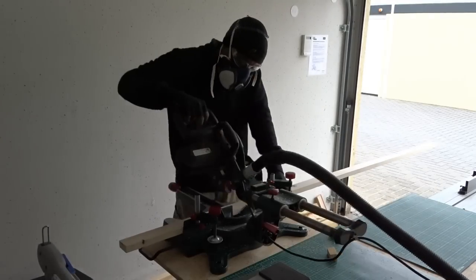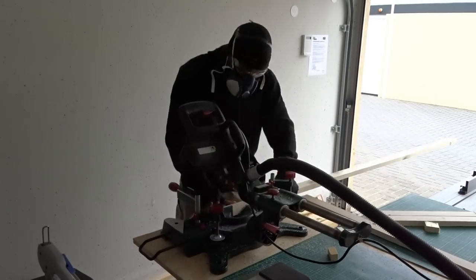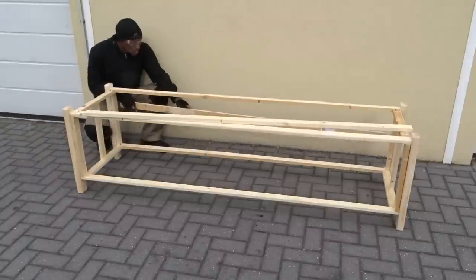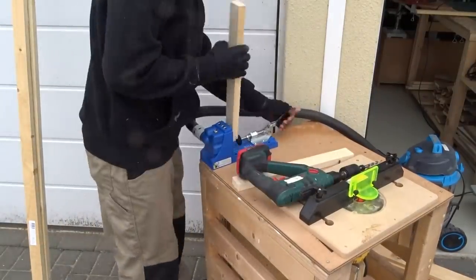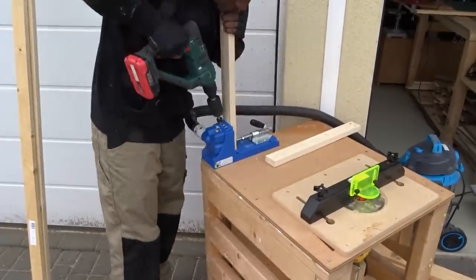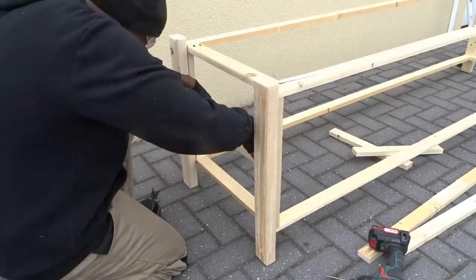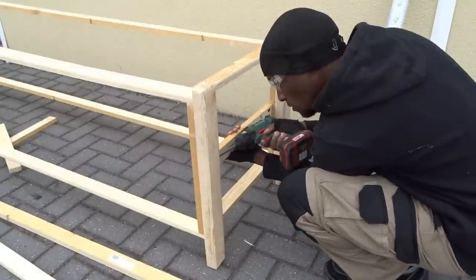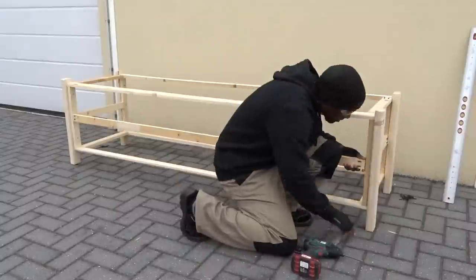This part is pretty simple, because I will be using exactly the same process as before: checking the dimensions, cutting the wood, and using my kreg jig in order to insert them into the frame. This will be the best way to ensure that all the pallet slats are properly attached to the main frame. It's always easy and fun to use the kreg jig, and if you are looking for a nice way to assemble any frame, I will strongly recommend it. Now that they are all ready, I'm going to attach them all to the main frame. As you can see, it's a very long and painful process, but at the end this will save me a lot of headaches.